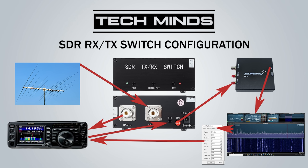Before showing how to set up the software, here's a diagram so you can visualize how everything connects together. The antenna connects to the antenna port of the SDR switch. A patch cable goes from the SDR switch to the radio antenna port, and a PTT cable runs between the radio and the SDR switch. Most HF radios have a PTT line that goes to ground when transmitting — consult your radio's manual to find the correct pin and port. Some radios have a dedicated PTT phono jack on the back, so it's worth checking. The SDR port on the switch then connects to your SDR receiver.